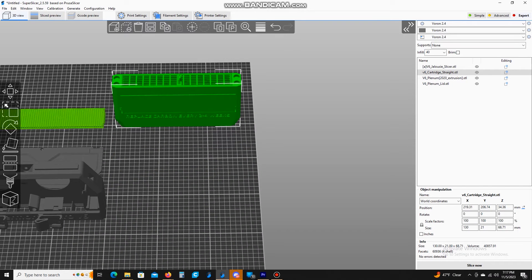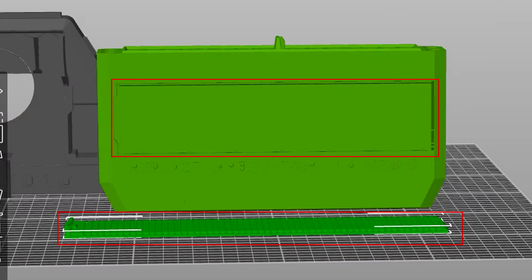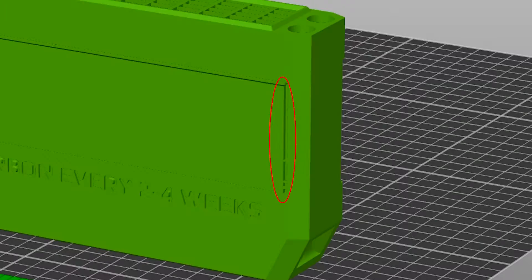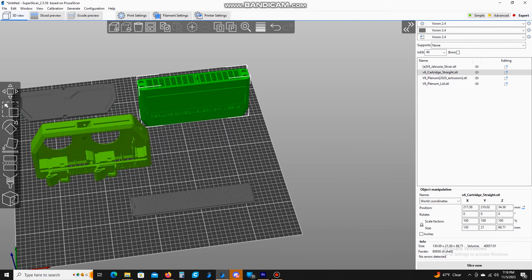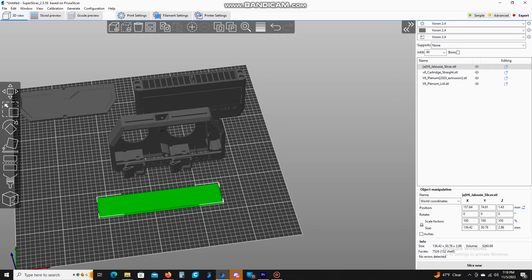It's very nice — you don't have to add supports or worry about adding them with this project, which can sometimes be a real pain. This piece is going to slide in here as a little slider door to keep it closed. It goes in the back area right here, comes up and slides through — that's what the notches are about so it can bend. A lot of people have problems printing this in multiple ways, so if you have issues you can add a brim. You also need to make sure your printer is well-tuned so it can bend without breaking.